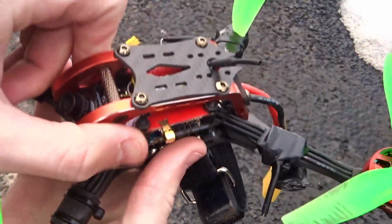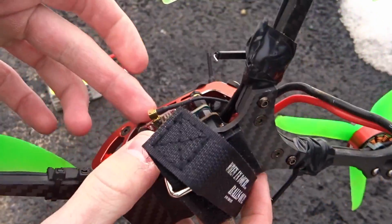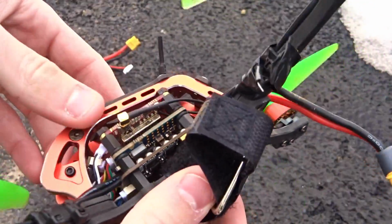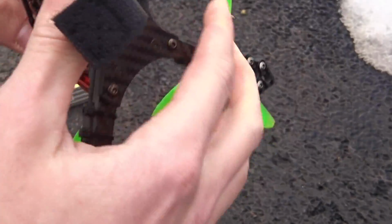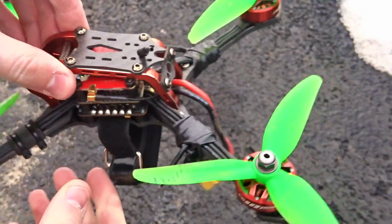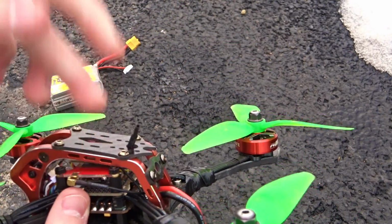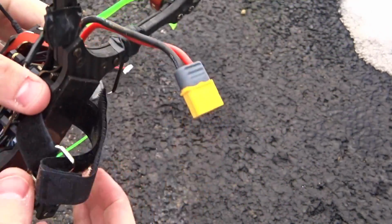As well as with the MMCX, it just sticks out the side here. It doesn't fit in the box, and this connector actually snapped off in the box, so when I took it out, I had to try and resolder the MMCX back on, and I think I got it connected, but it's really not ideal. It's stuff that just makes me not like MMCX versus if you just had a UFL in the middle where you could solder it and secure it.